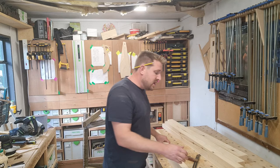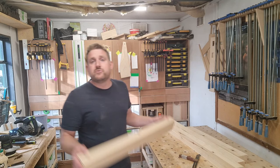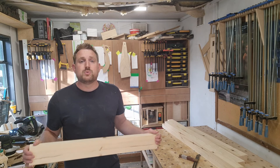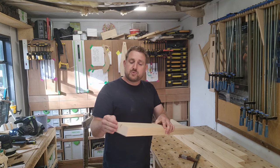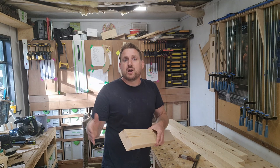We're going to do a really simple way that the guy that trained me, Andy, taught me. We've got a little bit bigger than his. He always says to me, when you build a sawhorse, it's 2'6", 6 inches in, 1/2 inch all the way around. So these are a little bit longer than 2'6". It means we're going to step in 6 inches, and then give it 1/2 inch splay one way, and 1/2 inch splay the other way when we cut the legs. And that will give us roughly the right kind of geometry.